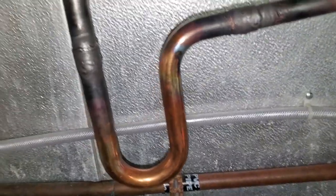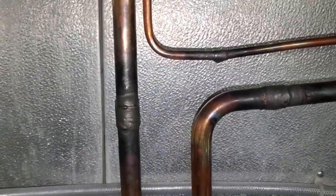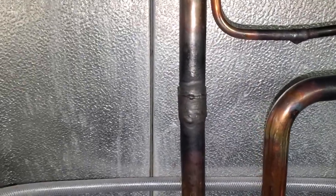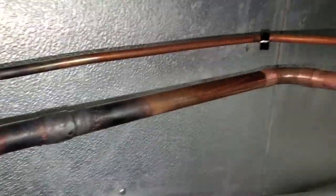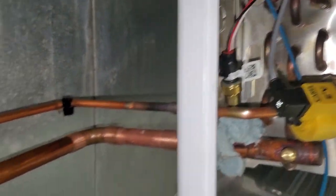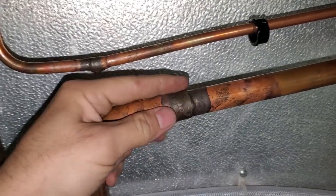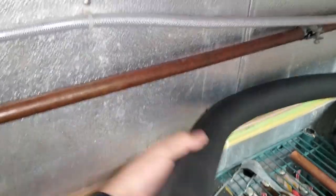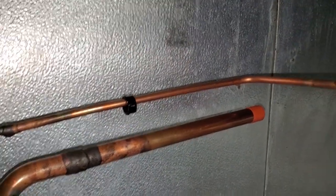I literally take my mirror and check every braze joint just because I want to be sure. Yes, it takes me a little extra time, but that's how I roll. I check every braze joint — I always have. I know I go heavy on my solder; I always have and I feel more comfortable doing that. I am brazing with nitrogen. So we got those ones done. I'm going to let them cool and then we'll slide on the insulation. Once they cool, they clean up really nice and look nice and solid — no problems. I always save these caps and throw them in my toolbox because they're great for when you're sliding insulation on — you don't have to worry about getting tape glue on the line.